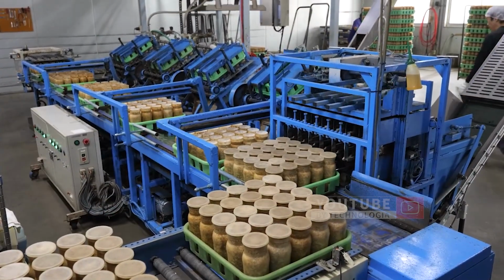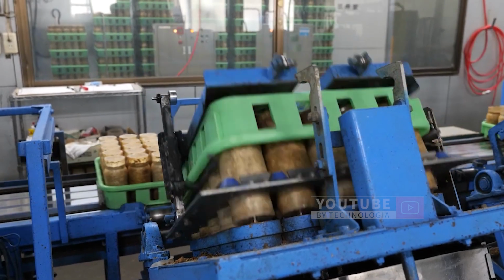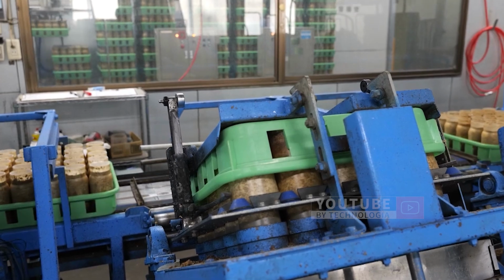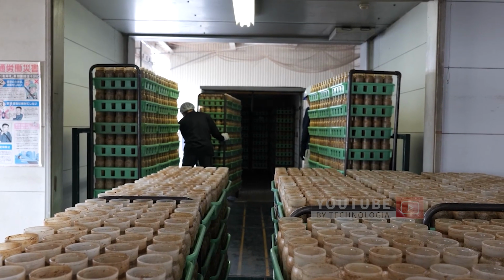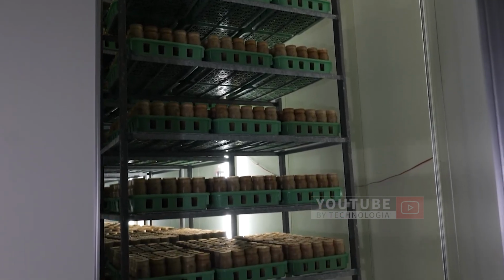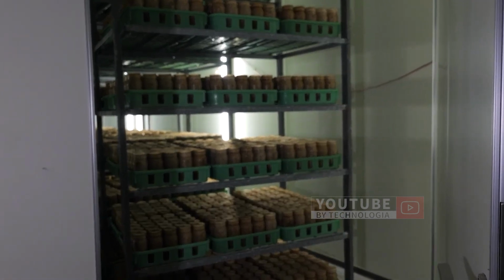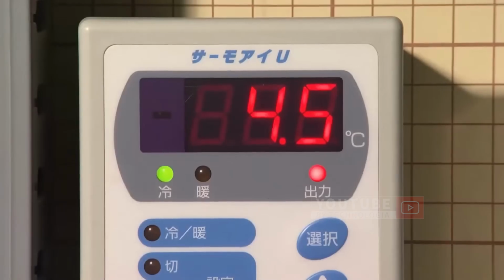Next, the cold planting medium will be placed on a conveyor to pass through the Enoki mushroom mycelium filling machine. The bottles, which have been filled with mushroom mycelium, will then be moved to the mushroom room, where the temperature and humidity will be maintained constantly. A computerized program automatically sets temperatures and ventilation openings. Workers only need to check that each tool works according to its function.